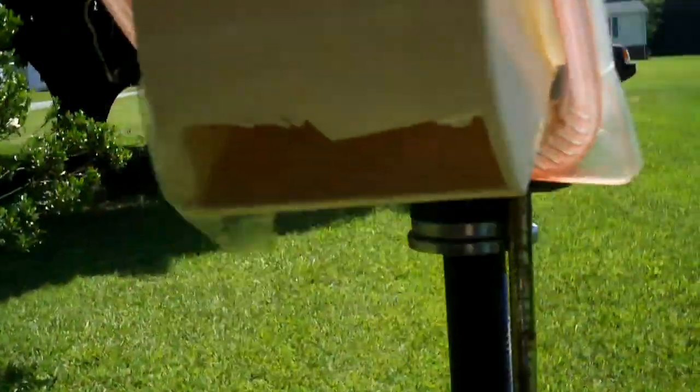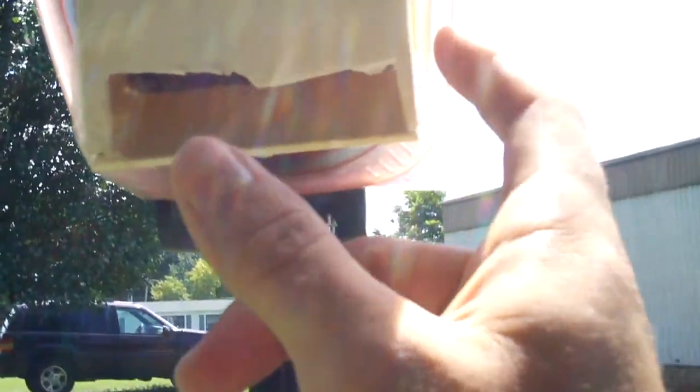The most recent thing I've done today was I had a cover on here to try to keep water from getting into the microphone, but I decided to knock a hole in it and tap a hole in this lid so that way air can enter inside the weather case while the camera's going — to help get some air circulation and keep things a little cooler.